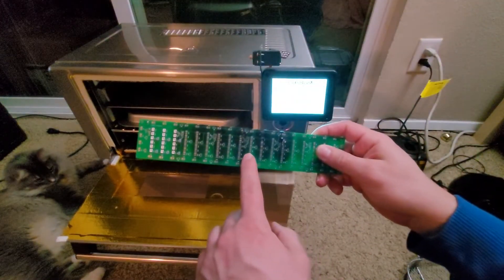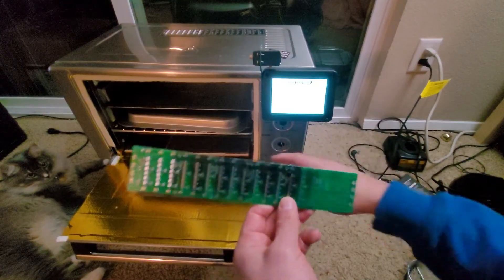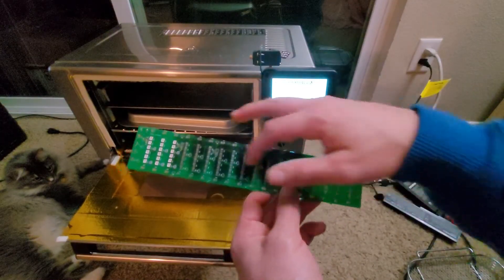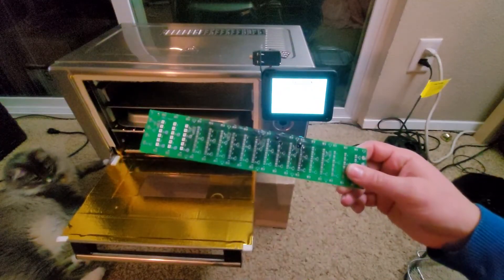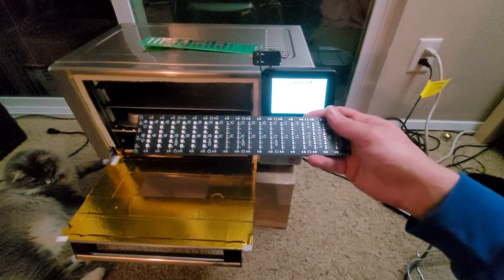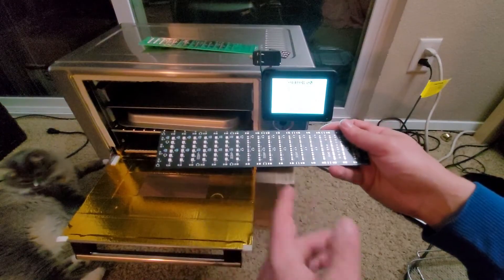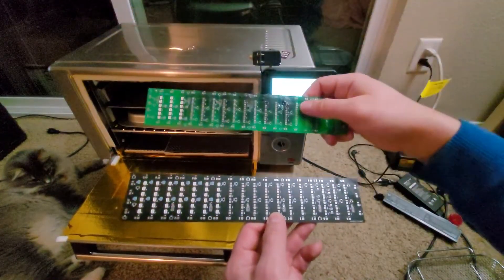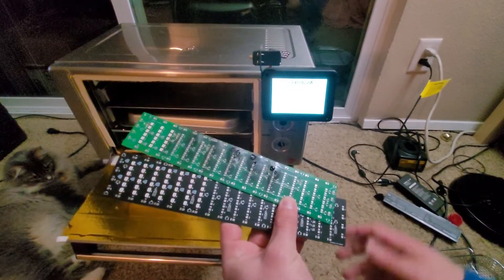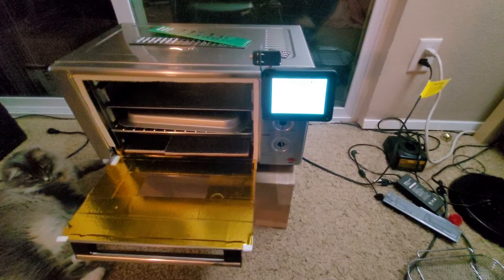Some of the tests we did when we were just using a straight up toaster oven, we had issues where it would burn because it doesn't switch between all elements the way this does. In a normal toaster oven, it'll just stay on, and that's what can cause burning if you don't watch the board really carefully. On the old oven, we were able to get a decent reflow, but it took a lot more work and you always had to be sitting there watching as the solder would melt. With this, we just threw it in, walked away, and let it do its thing. Overall, I think this is going to be a really cool device to use and I definitely can't wait to use it in upcoming projects. Thanks for watching, please like and subscribe.